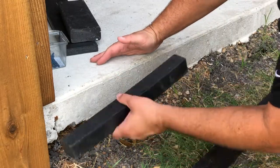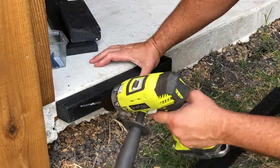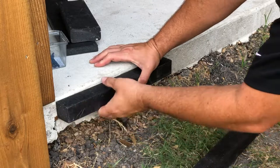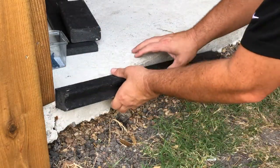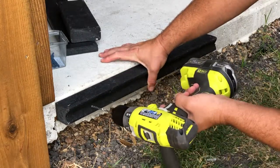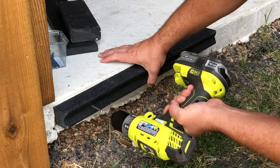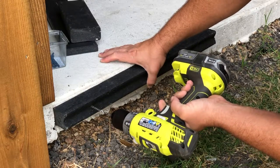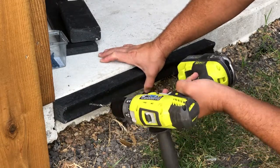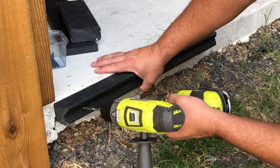I've got just a little better than a one-foot piece here, but imagine this is 12 feet long and you're trying to get it right where you want it. With a standard piece, it can easily wander off the material. That's where the V-groove comes in. You're holding this V-groove up right where you want it, and the V guides you to the center of the material — much less likely to wander.